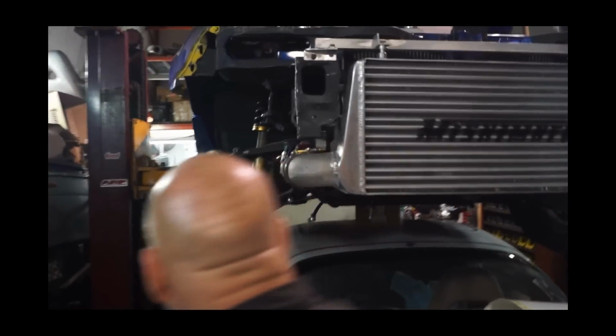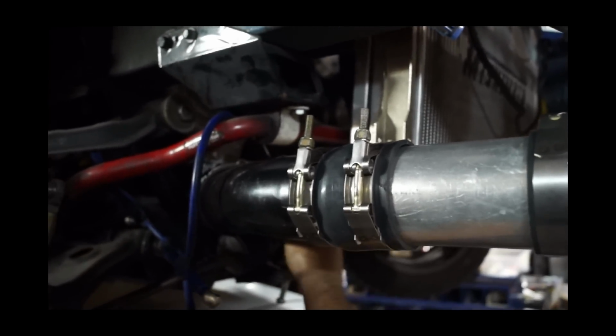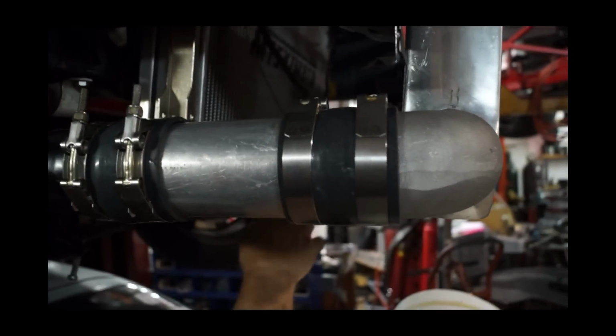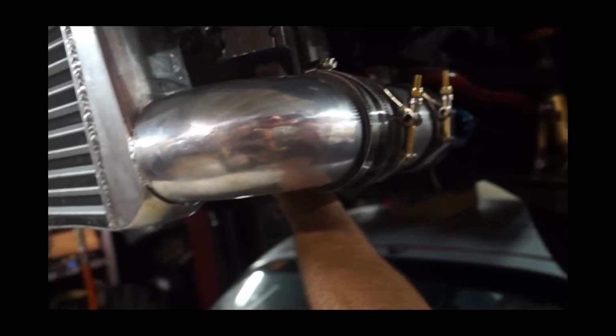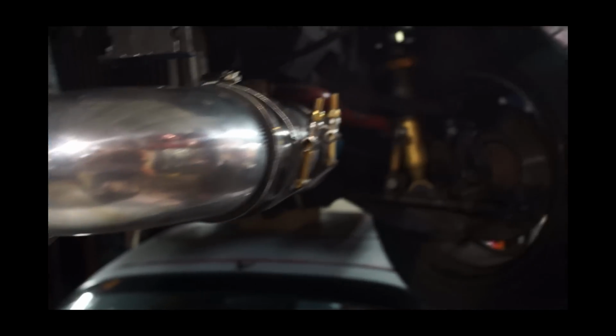It's just in this car, it turned out to be a lot more compact. It's essentially the same thing, but with the turbocharger housing volute turned down and the outlet coming straight out the bottom, it's cleaner. And on that side, it's basically the same thing, underneath the radiator, behind us, going up. But there's more space between the radiator and the intercooler by virtue of the body of the car. Before, the intercooler was over here, and I really wanted to separate it to gain some air density. A lot more tidy, a lot less travel for the air.